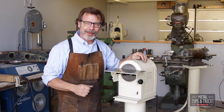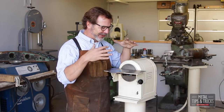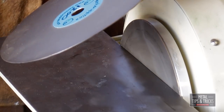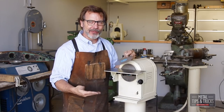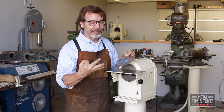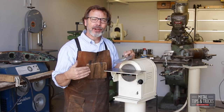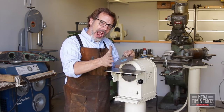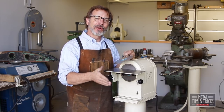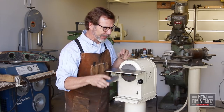I want to talk about the different types of discs we use. One of the questions I'm getting asked the most is what am I using as the sharpening surface. It's actually steel plates impregnated with diamonds that come in all different grits. The grits I'm using are 800, 1200, and 3000. The 800 is the coarsest — that's where I reshape the carbide into the geometry I need — and the 3000 is for final polishing and real sharpening.